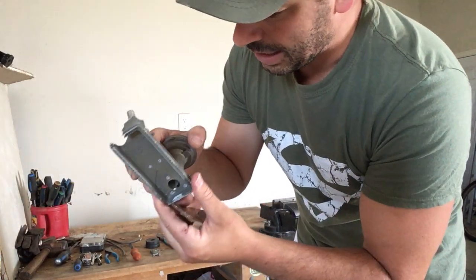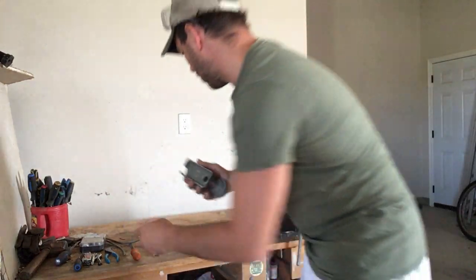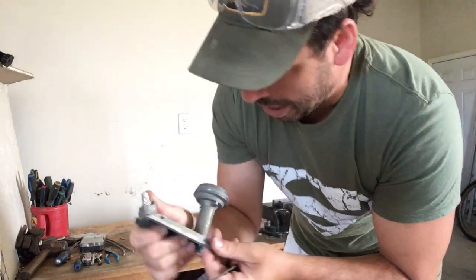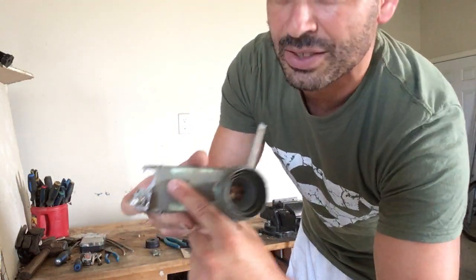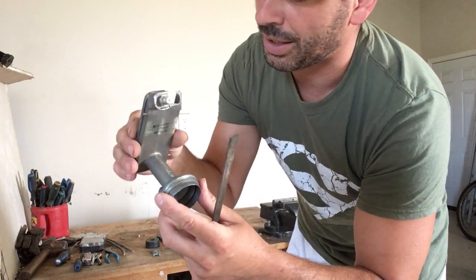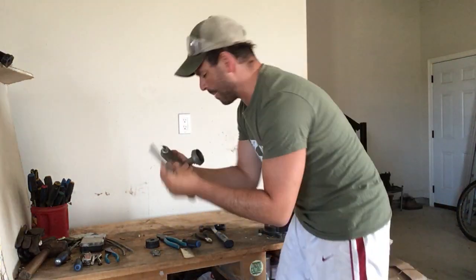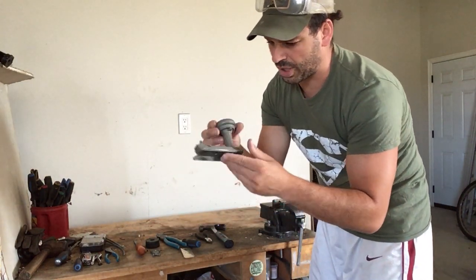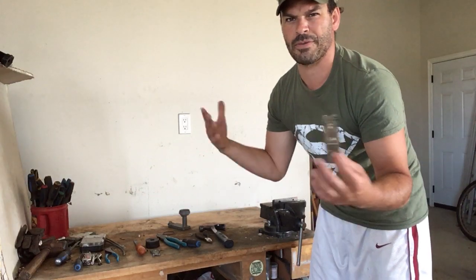Now this piece — I think there is a little bit of metal that is not cast aluminum, this one right here. So this is actually going to go into dirty cast. I'm going to pick up a file and scratch it. I'm going to throw this into my dirty cast because this is not cast aluminum on the side here — the bottom is. So this is going to go into just my dirty cast. It's also because I have the pin here. Some scrap yards won't be too fussy — I might just hold this off to the side and they can put it in where they want. This isn't very heavy at all, but very simple to take apart. It took me five minutes to do.